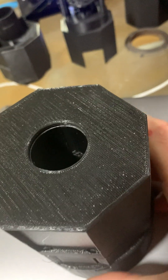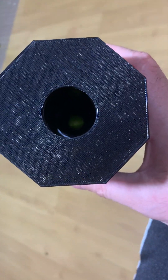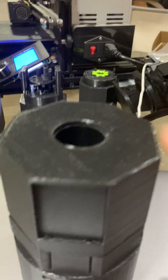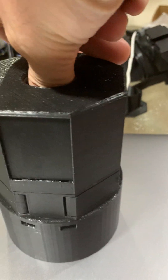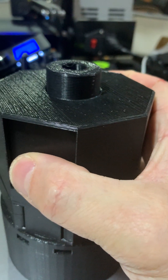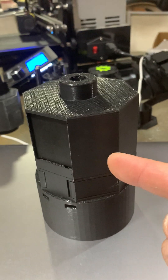If we look down the tube, you can see shining in there — one of the pieces that engages in that slot. Basically if that doesn't come all the way up, the engagement doesn't happen. I can pull it up manually and you can see the gap is now closed, the button comes out a little more, and it clicks in — you get a good bite. But I don't necessarily always get a good bite the second time, so those tolerances are pretty important.